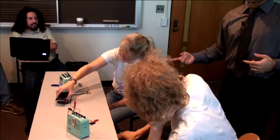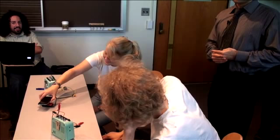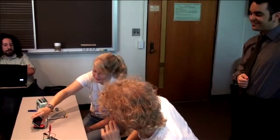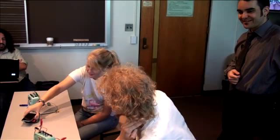And the chirp is it's periodically reading the accelerometer. And then when it sees a new measurement, it wakes up again, throws the chip into low power mode. Because the chips can still sample once every second or something. They can take a sample off the accelerometer. That's amazing that you can hear that. There's some side channel attacks just waiting to be exploited.